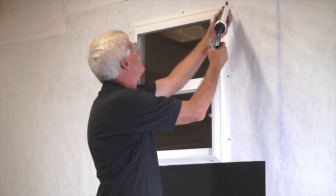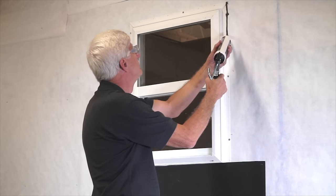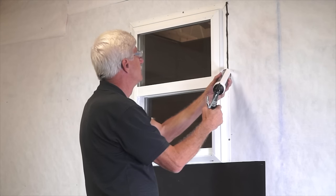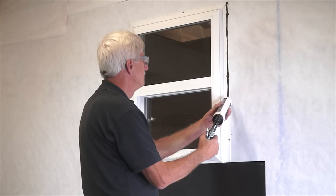Use the same sealant technique for the jambs of the window. Continue the bead of sealant at the jambs vertically, a minimum of 8.5 inches above the head of the window, to allow for bedding the top portion of the jamb flashing into the sealant in the next step.